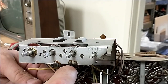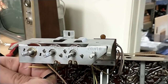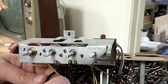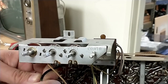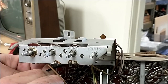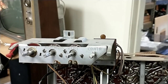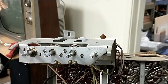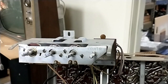I'm going to take this resistor and wrap it around the exposed wire on the lead that I cut off and stripped of the old potentiometer. And this is just providing a better mechanical connection. And then we'll solder the end of that resistor that I've just attached to this thing here to the potentiometer. And of course, cut off the excess.